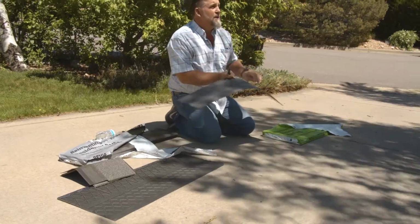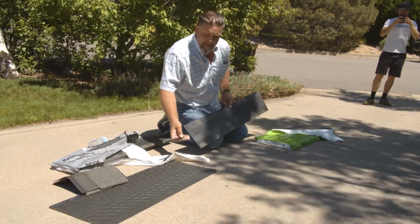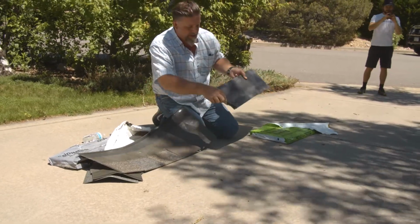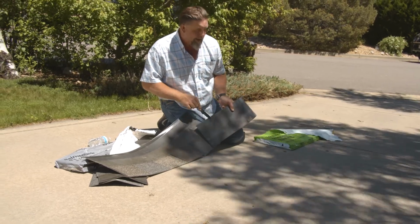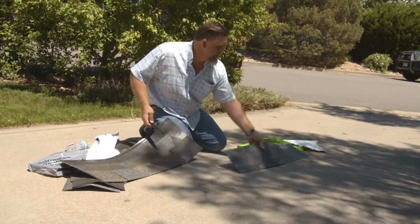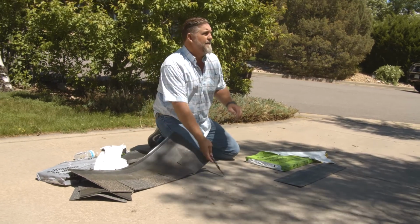So this is your starter. Universal piece. It's got 4 different colors on it to match up with whichever color shingle you end up installing. So you've got this color here, it's going to match this one here. You're going to do a black one. You can do black. This one being square, it's not as important. You can just line it up any which way you want to go. The starter is going to have 6 nails.